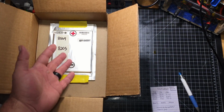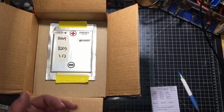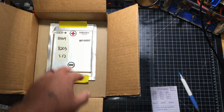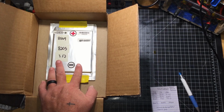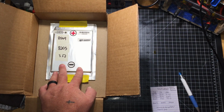And of course you're going to get a higher capacity. That's basically what most dischargers do: they lower the amperage as you get to whatever voltage you decided on. These are spec'd to go down to 2.5 at the lowest, and if you stop at anything higher than 3 volts, you're going to lose about 1,000 milliamp hours quickly.